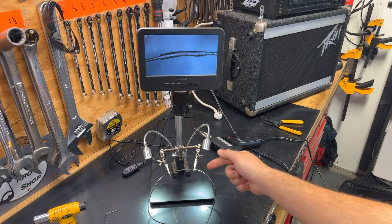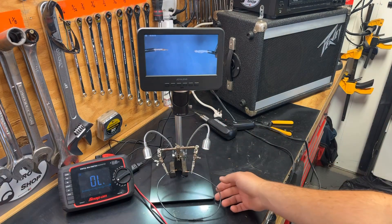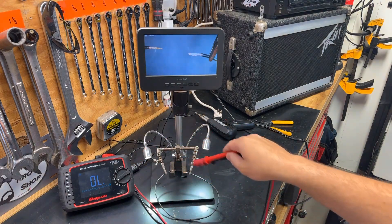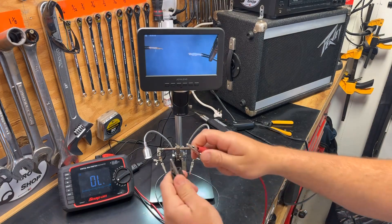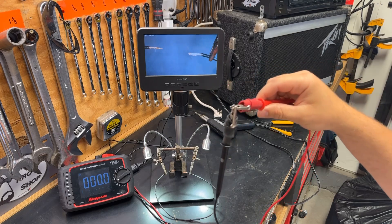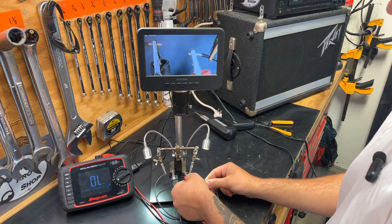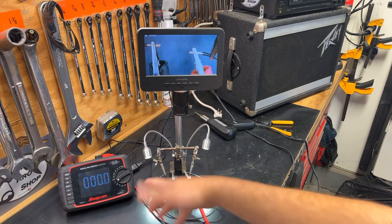And there you go, fellas. That is the best solder joint that you could possibly hope to get. Now, just for kicks here and to prove the point that this is a good solid solder joint, go ahead and hook up my meter. Obviously, you're not going to have to do this if you're actually repairing a wire, but for the sake of the demonstration, we're going to ohm this thing out just to see how good this joint is. Set up the meter to ohms. Whenever we put it together, we get an audible tone from the meter and it shows our resistance. So right there we have zero — it's absolutely perfect. So we know the meter is working right. We'll hook up the two ends of the wire that we just soldered. Look at that — negligible, almost nothing. It's zero. It's perfect.